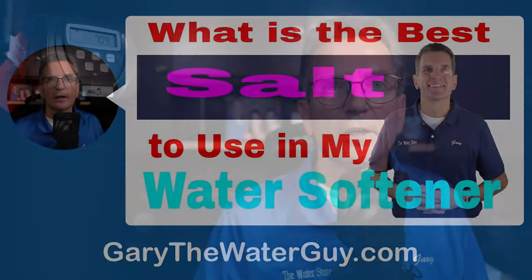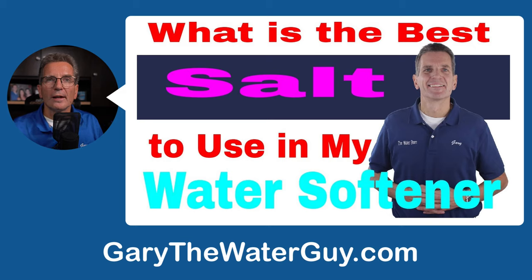The kind of salt you use is a maintenance item — it's very important. If you use rock salt, part of that granule is salt and part is dirt. The water absorbs the salt and uses it to regenerate the media, but the dirt stays behind. Over the years, it sinks to the bottom and you get more and more dirt in the brine tank. I always recommend a salt that looks like a tablet or pill — that's the best kind.